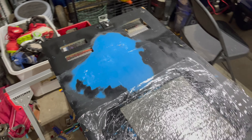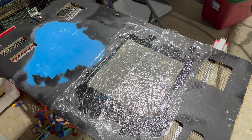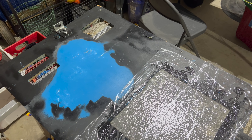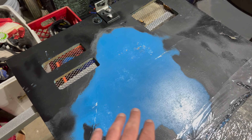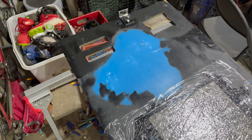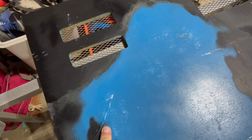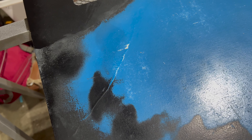With the sides painted black, I want to take off the black paint and hopefully recover the blue paint and side art underneath. There are a couple of ways to do it. The safest technique tends to be magic erasers with 91% isopropyl alcohol. I spent a couple of minutes last night testing that on the back door — figuring if I screwed up the back door, who's going to see it. It worked, but it was a bit of work, and in some stubborn areas or where the paint was heavier, I may have overdone it with the magic eraser and taken off some of the blue underneath.